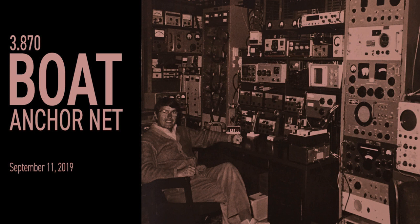You might have a better idea than I do. No, I was just going to say on the Heathkit ones, I've used a hair dryer, not a heat gun, but a hair dryer in low position a little bit, just to warm up that tube a little bit and try and adjust it as it's warming up. I'd say half the time they'll come loose. Otherwise, they'll break like Mike said.